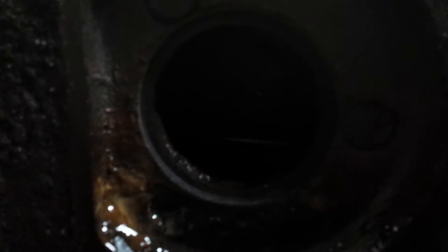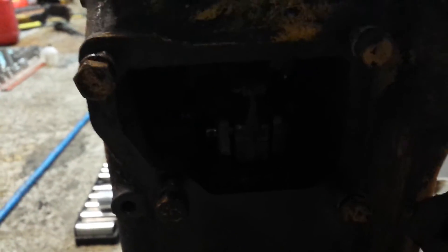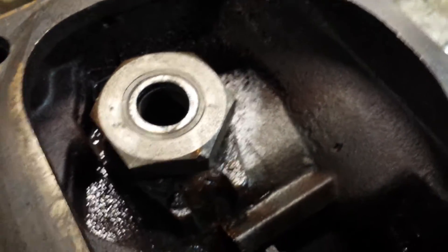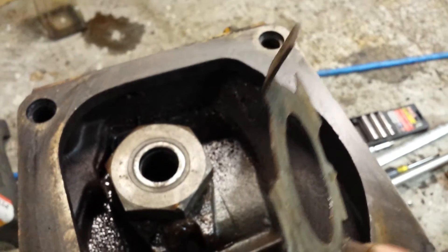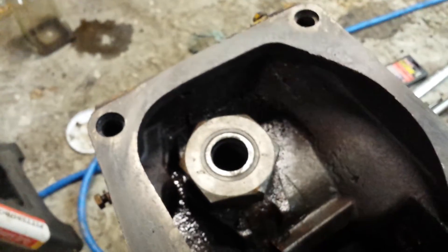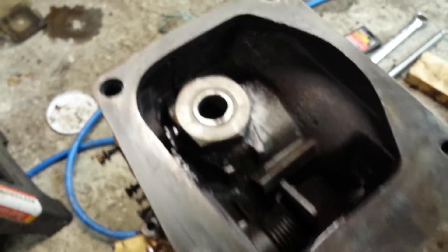The power assisted output turns a much bigger gear on another shaft, which are the actual drive shafts. You can see the PTO shaft that comes back, but in my case since it's the backhoe version it's plugged off with a cap. This is the directional reverser housing — I have some cleanup to do there. I still have to press out the rear clutches. There's actually a metal ring that goes around this that I already took off. I tried to tap it through but it wouldn't go, so I'm going to press it so I don't mess it up. It uses a ring with tabs folded over to hold the nut in place — it's a three-inch socket nut, so you'll want to pick one up to take that piece off.